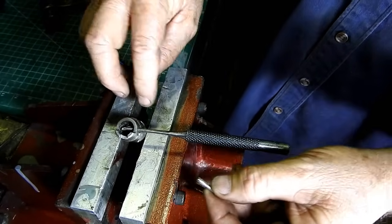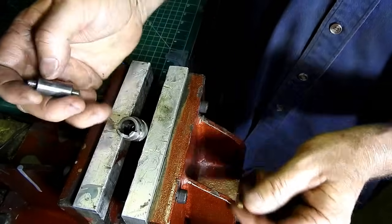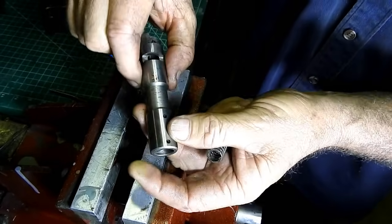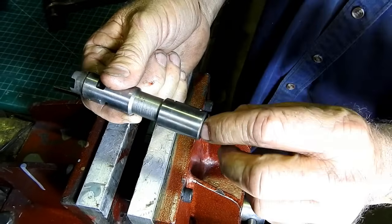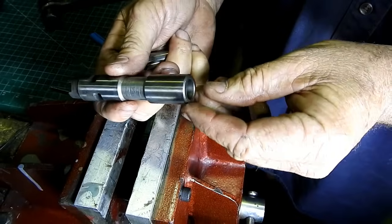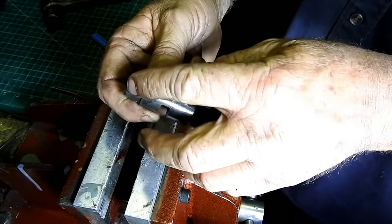We take a roll pin punch or pin punch. There we go. You can see where the valve's been touching the roll pin - these break, I have seen these break and one of those ports opens up a little bit. So you can pop that valve out - that's what it looks like. Now we open this up - that's your spring, make sure your spring is good. Also check that roll pin: it should have the gap away from where the spring goes, that's what I like to see. These two lugs here, they locate. When you come to putting it back and you have your pliers on the end of it to push it in, push and turn it - you'll just feel it go and drop in that little bit. Without that sitting in the correct place, these ports aren't lined up properly. Whatever you do, don't try and do that inch and a quarter spanner up until you know that's in properly.